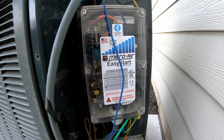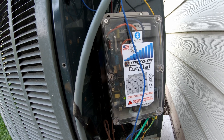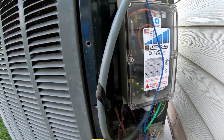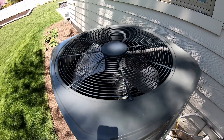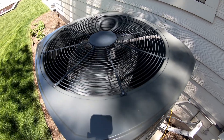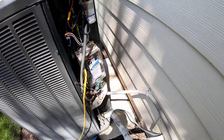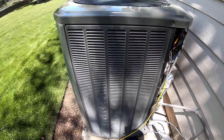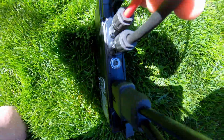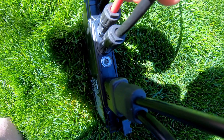I do have a Micro Air Easy Start — I have a whole bunch of videos about that. It makes a world of difference when you're trying to run it with a backup generator. However, it does not play a crucial role in powering this off of solar. So that fired up. Let's see what the light is doing over here. Now it's flashing orange — it's seeing the grid. This has a few minute delay before it starts exporting.